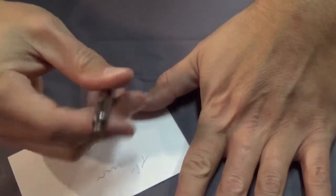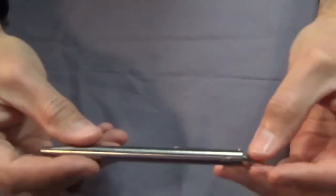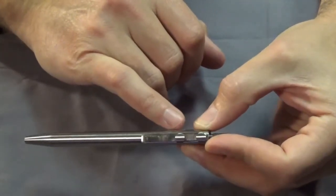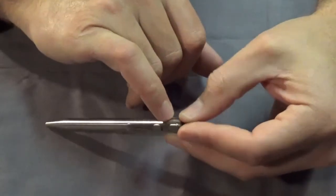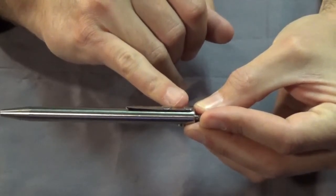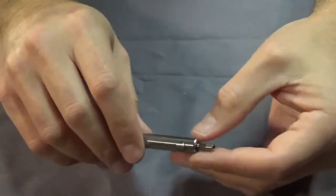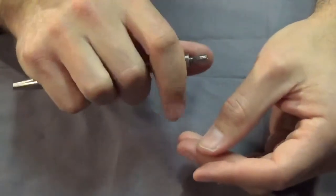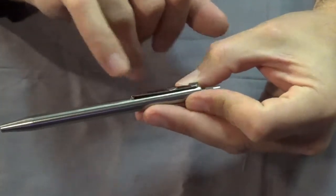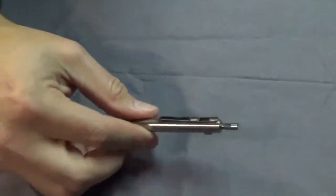Put the barrel back on, put a piece of paper to stop from scratching it up, screw that on, and it should write. There you go! And to retract, just hit the little button, and it clips on the shirt nicely. The other one I have is very similar, but it has two buttons or two screws. This has the added benefit of allowing you to drill completely through the body, which puts a flatter surface for that spring that pushes the little button, so you end up with a slightly better action.